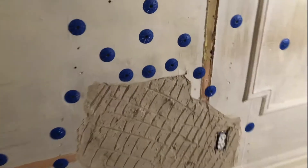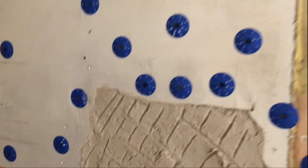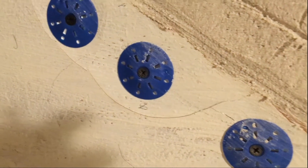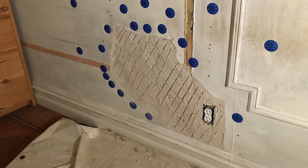Here's a moving view — there's my electrical box, and you can see all that old paint from the molding. Those cracks you can see underneath the blue clamps indicate just how much I'm pulling the wall back to the lath and how much it's been pushed away by the broken bits between the layers of plaster. Then we have a couple of shots of the scratch coat as it dries.